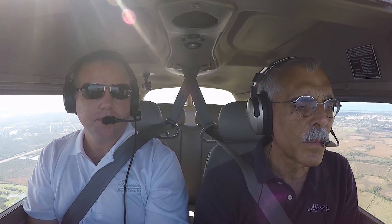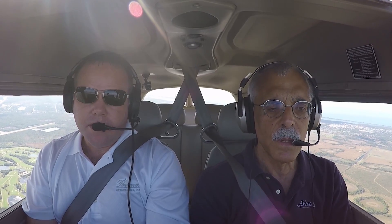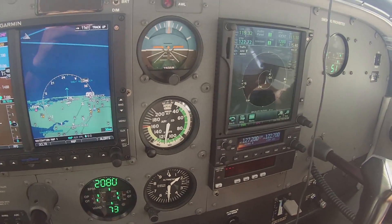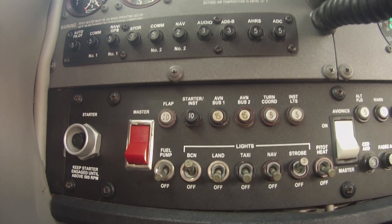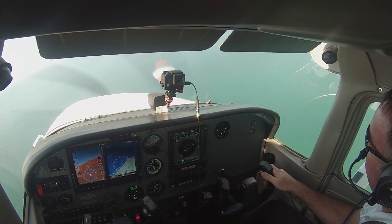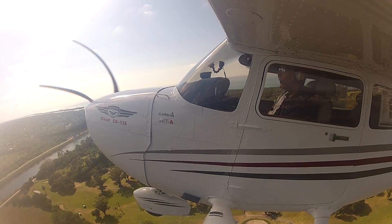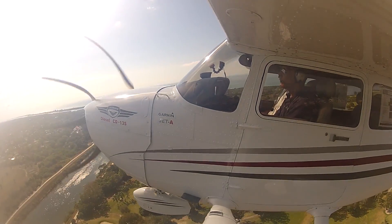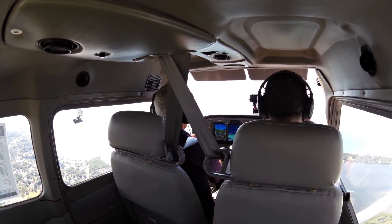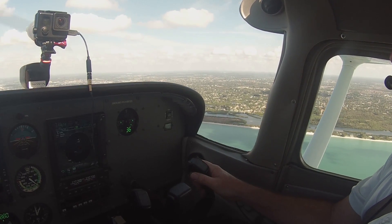Back in the cockpit with Corbin. Tell me a little bit about the equipment in this airplane — is this what's going to be typical? This is our Premier Edition, and it has the latest ADS-B coupled up with the G500 multi-function display. This would be the premium package for someone who wanted to do the STC kit on both the engine and the avionics, with every safety-enhanced device any pilot would want. The flight training market may vary by operator, but having ADS-B provides traffic awareness — we can keep our eyes outside and also have that third eye inside.